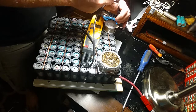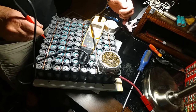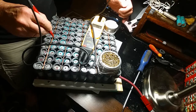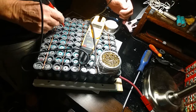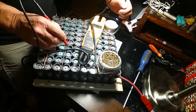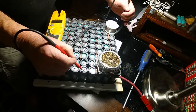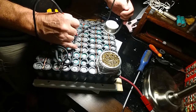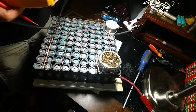Last but most importantly, we want to verify that all of our soldering joints are good. Use a multimeter — preferably one with a continuity tone, which is much simpler because you don't have to look at the meter, you can just listen for the tone. Connect the negative to your bus bar and just touch anywhere on the battery other than your solder joint and make sure you've got continuity to the bus bar. You'll do the exact same thing on the fuse side.